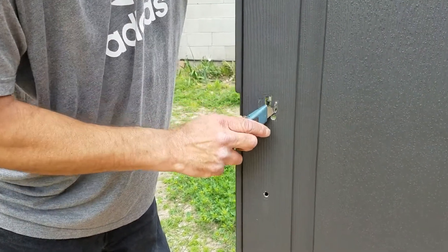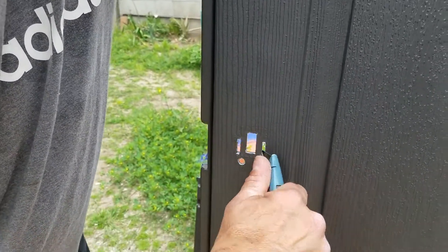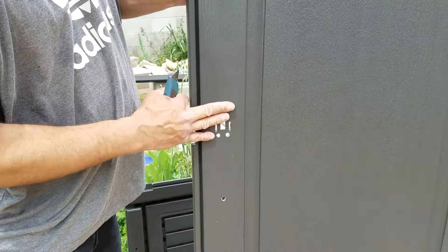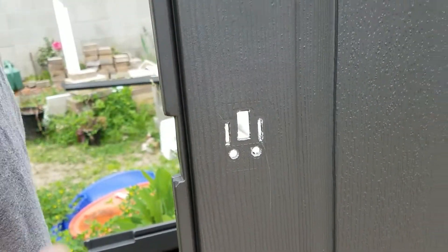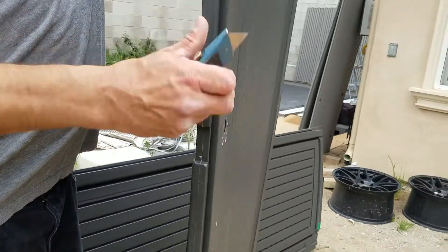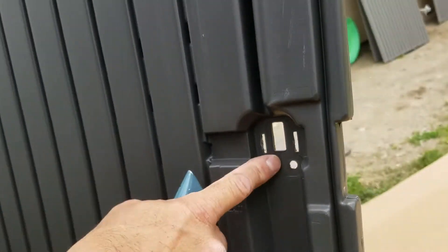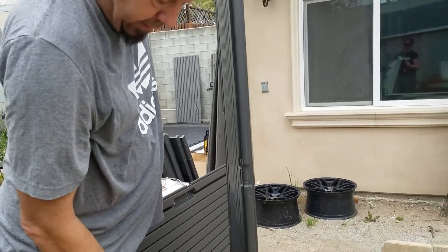First thing is I check all where the door handles are going to go through on the plastic, and you have to deburr — most of the time — you have to cut off all your excess plastic buildup that's there in the door so the handles fit nice and flush. You have to clear out all the excess plastic, deburr it. Sometimes I slice the edge if there's excess plastic there, because you're going to slide a door end channel down there in a minute. This looks like it's the right door.